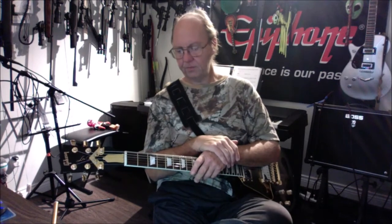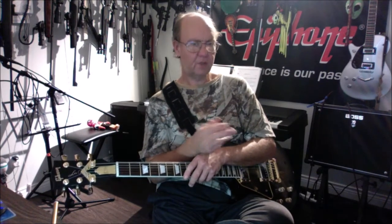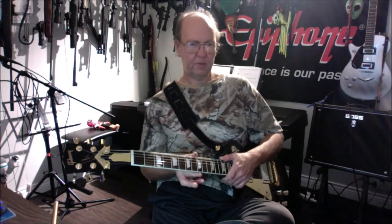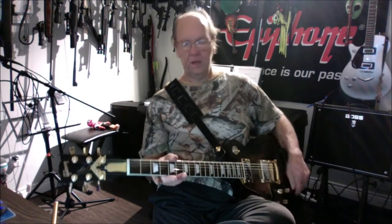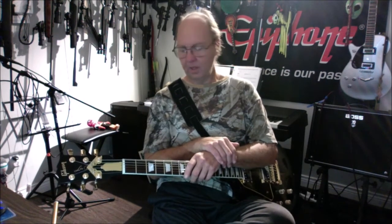And that's pretty bad, because see, the problem with nitro is it doesn't cure 100%, or let's just say it cures, but it doesn't cure hard. It cures more of a softer texture to it. So even leaving a guitar with a nitro finish, no matter what brand, in even a guitar stand for long term is actually a bad idea, because wherever that neck is resting against, and even the body down below, especially all that weight, it's going to start making impressions over time into the neck and into the body that you're not going to really like, and there's no getting that out.